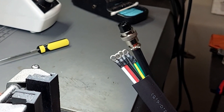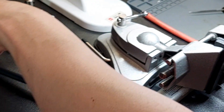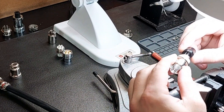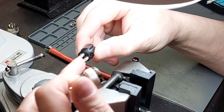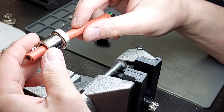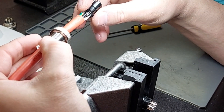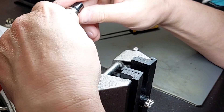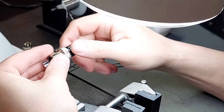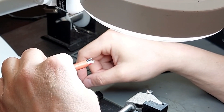This is Deoxit Gold — they were all treated and this is all set. I make little design changes, and the main design changes I make are for ease of use for myself and for my clients. You can see how this connector is assembled. Like all the others, once you solder on your conductors, your casing will be down the cable. When completed, the connector will be connected to the conductors, and the casing slides up to mate. In a perfect world, this should allow you to just thread on just like this — being completely perpendicular with your conductors. That's what we're looking for.